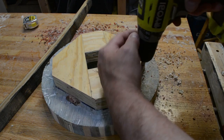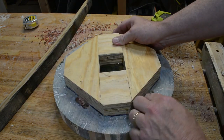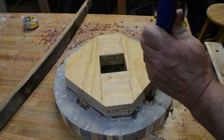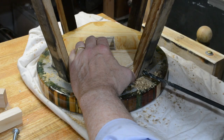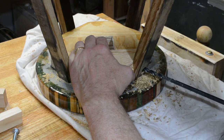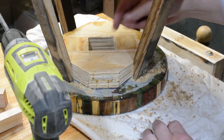Now I can pull out that temporary circle piece. Screws alone aren't going to hold the legs, so I wanted something tougher and a way to lock those legs into the top. I cut a little channel with a Forstner bit and chiseled them out square so each leg fits down into that channel — as you pull it close to the plywood form, they lock together in place. That's a great mechanism to pull these pieces together. From here, I drilled all the way through the stave and through the plywood form, then used a quarter-20 bolt to pull it all together and lock it into place.